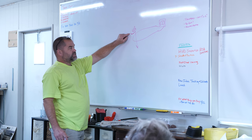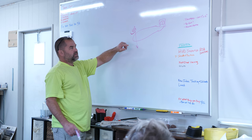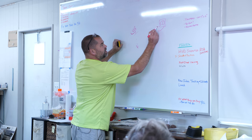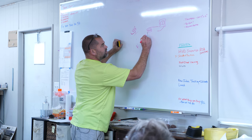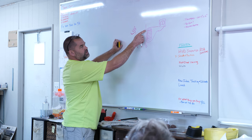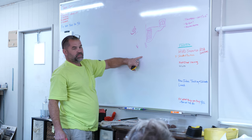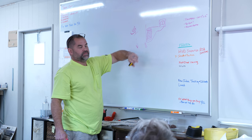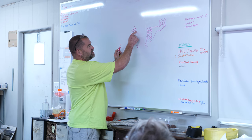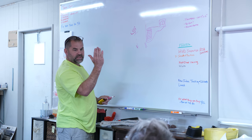So this will barely blip one way, a little bit the other way. Increase the size of the magnet and we can get it to move a little farther. Increase the speed that you're passing by — almost like you're hitting it — you can get it to move farther. The best way to increase it: take that wire and coil it up. Now when you run that magnet down past there, you just ran it past there that many times. Big powerful magnet, moving quick, going past a bunch of coils — now you're really starting to make voltage.